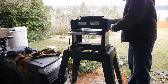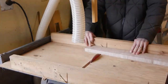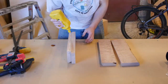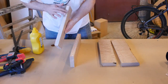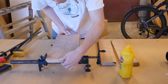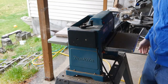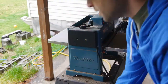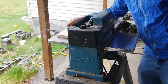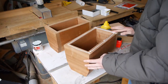So again, this project is just presenting some issues to me that I'm not getting too excited about. I cross cut the pieces to get what I need for the baffle, and then I just edge glue them together — because we're bookmatching this to get the ultimate width I need for the baffle. Nothing too exciting here. And now that they're glued together, I give them a quick plane, just to get the excess glue off and make sure they're flush and even between the two faces, which means I lose even more bookmatching.